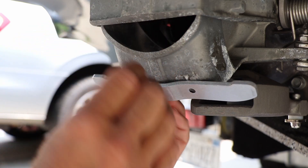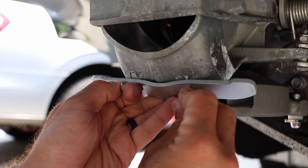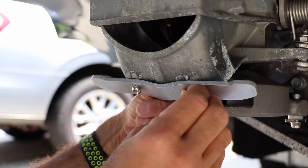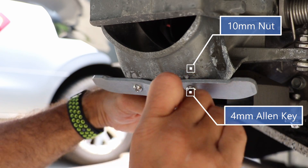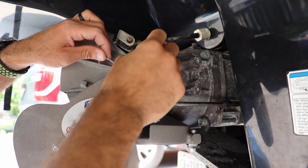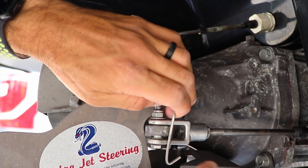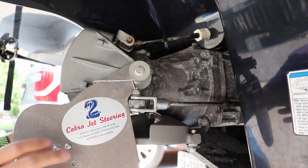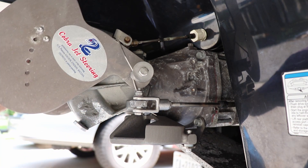Take the screw and secure it from the other side with the lock nut. Use a 4 millimeter allen key on the bolt and hand-tighten the lock nut with a 10 millimeter wrench. For the last step, put the spring back into place — rotate it clockwise so that it catches the back of the fin, then spin it around so it hooks the front. If you lift the fins, they should move up and down without any scraping, and if you push the nozzle from side to side you can also check that there is no rubbing.